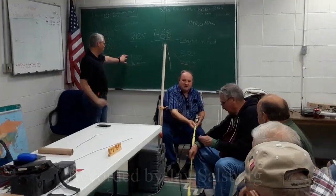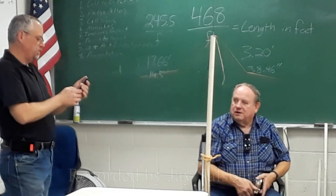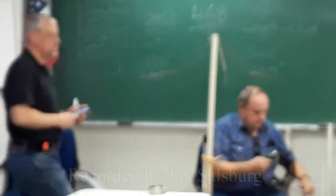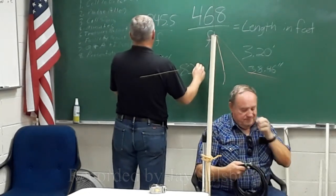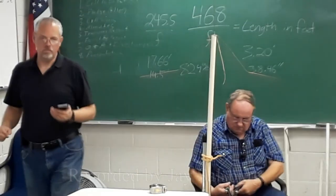Okay. So now the difference is your velocity factor. So I'm going to take 14.5 divided by about 17.7, which equals 0.82. That's about right. So the velocity factor is about 82%. I see foam and polyethylene and all that. All right. Slightly different.